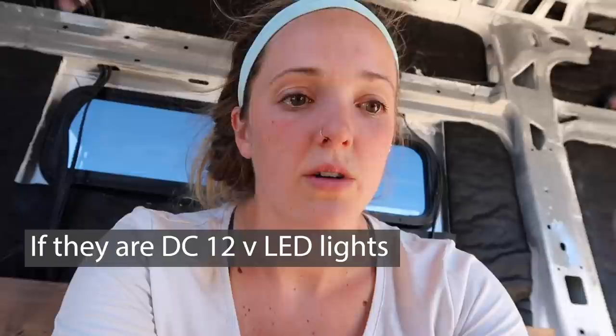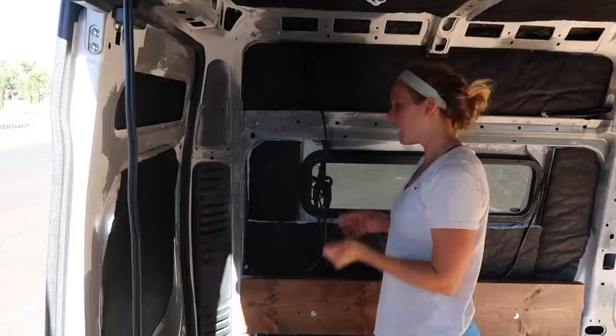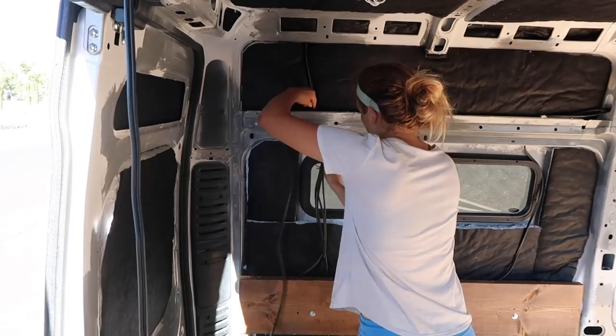The more research I did today, it actually does not make sense at all. A few articles and videos said you actually cannot hook up LED lights in series — they need to be in parallel. So all of my puck lights, all of my LED lights are going to be run in parallel. For each appliance, I will show exactly how I install it and what wires I'm using. So my last few steps for this initial pre-wiring process: I'm going to finish running my DC stuff other than my lights, pull out those wires I don't want, and then make sure all of my wires are protected — whether that's with conduit, rubber grommets, or some silicone — and I'll show you how I do that. So these were supposed to be my bed lights, but now my bed lights are going to be run in parallel, not in series.